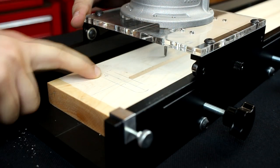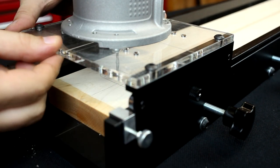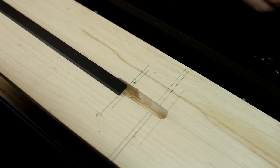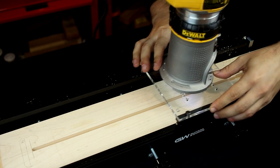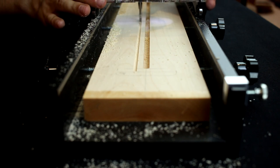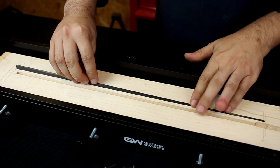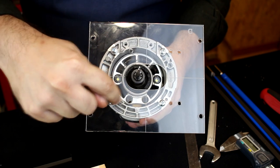Our drawings feature the carbon rod channels a little bit further than the truss rod, so we have to adjust the stopper position. The channel length will vary on whether you want to spend some time sanding the carbon rod edges to make them round, to fit properly on the round profile caused by the bit. Now we should proceed to route the other carbon rod channel.